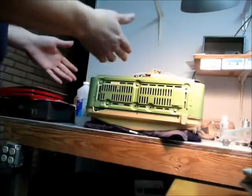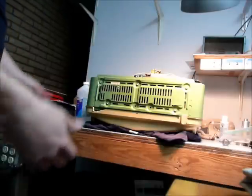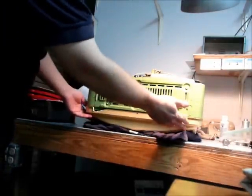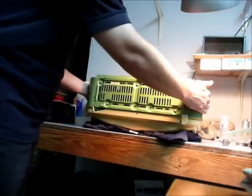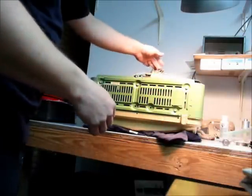What's tricky about these is you've got it laid face down, and there's really no other good way to do it. Basically what you're doing is — the picture tube is attached to the front mask of these Philco sets, the 17 or similar — we're going to lift the chassis and the metal wrap-around body straight off of the picture tube assembly. That's why we unplugged everything.